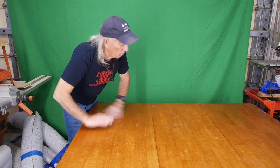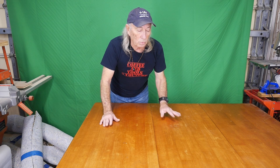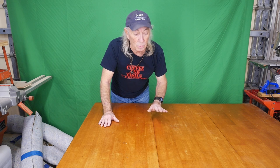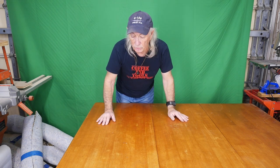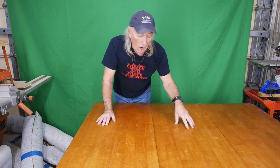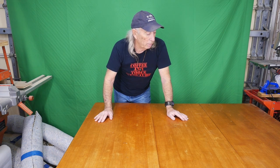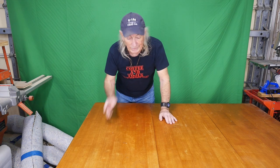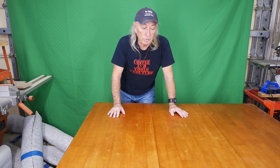Let's go over it real quickly. The table is nice and straight. I've cleaned it up since we dragged it home. There are nicks and scratches throughout, but if we wanted to make this a really nice dining table, we'd have to sand it down. Because it's solid wood, yes, you can sand till the cows come home — you're dealing with real wood, but you will have to restain or whatever color changes you want. Looking underneath, you can see the actual original color of the blocks is not anything like what's on top because the underneath was never stained or treated. You could tell this was good quality wood but in block form — butcher block type styling, probably just glued and pressure clamped before being cut to create the table. Probably no biscuits or anything like that in here, but it still makes for a really good quality solid wood table.